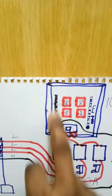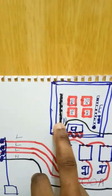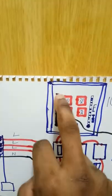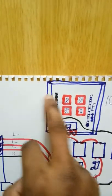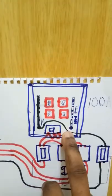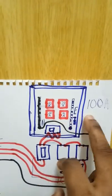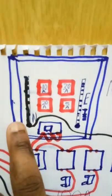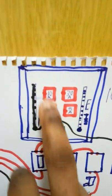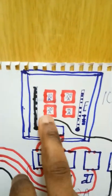There is a copper rail with screws where all the neutral wires will come. There is also a copper rail with openings for screws where all the earth wires will come. This is also a demonstration of the circuit breakers — the live wire from every circuit will come here.